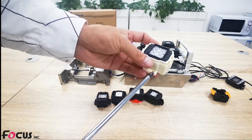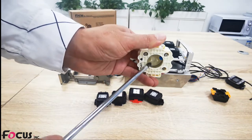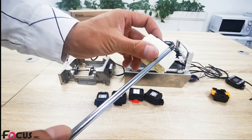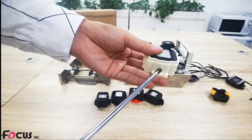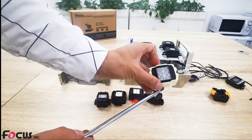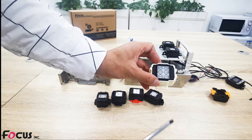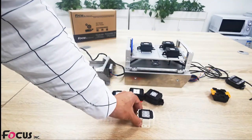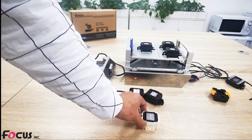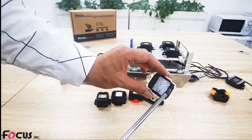This next one has the same motion system — ink also easily leaks out from the edge when waste ink flows through. Additionally, if we install this kind of cap, it is very hard to align the print head because the hole only allows adjustment in the Y position. You can only adjust left or right, but cannot adjust up or down. So this cap has both ink leakage and alignment problems, and we throw it away.